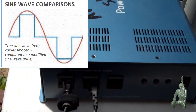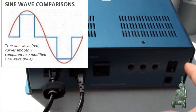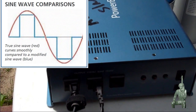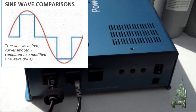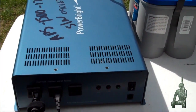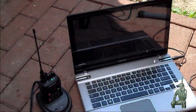Now this is what they call a pure sine wave inverter, and there's a difference. Inverters come in modified sine wave or pure sine wave. A modified sine wave looks like a staircase — the sine wave itself. Some computers are more sensitive and need that pure clean 60 cycle sine wave like the power company gives you, in which case you need a pure sine wave inverter. I recommend that for your computer equipment and your electronics equipment.